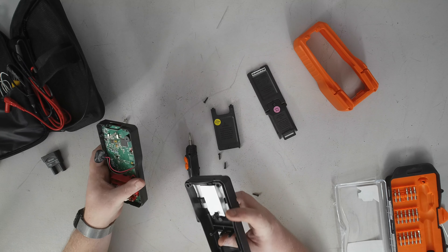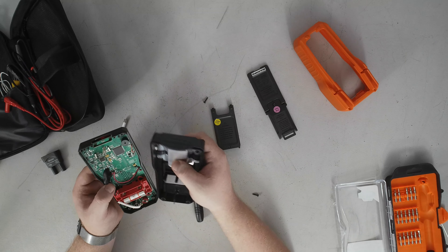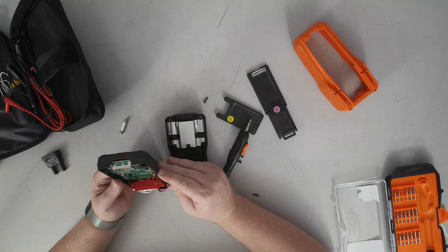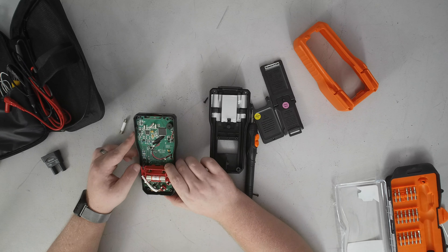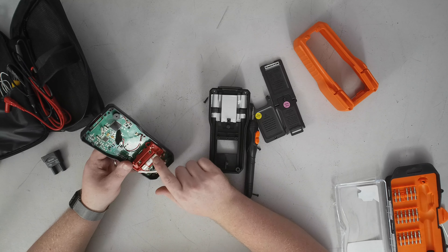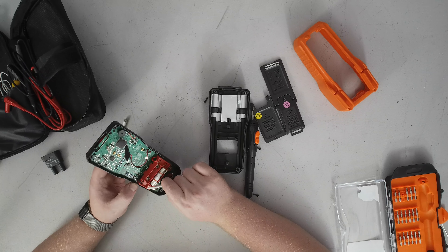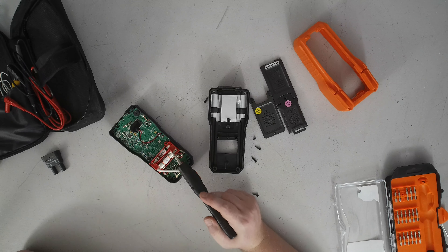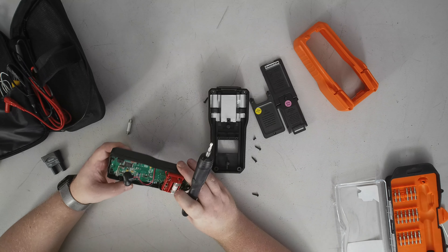There's a spring attached to a section of foil here — it's supposed to do non-contact voltage detection. I wonder if that's what it is: to allow it to read the differential between this and that plate. Looking at the current path, it goes directly through that fuse and then jumps through a pretty hefty size wire with a second layer of insulation, so if you have 10 amps jump through this, it's not just relying on the printed circuit board — there's actual dedicated pathing for that.